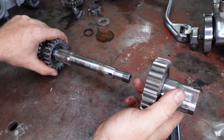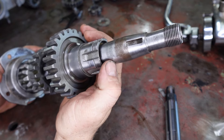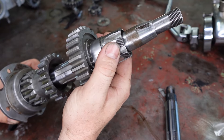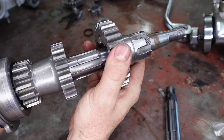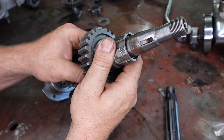You just want to put this on your shaft like that and just fiddle it around, do it in a couple of spots. You can see the little witness mark there where this gear lives. You can hear it — there's a lot of movement there. There is some sort of tolerance in the book, but basically if you can knock it around like that, it's no good.